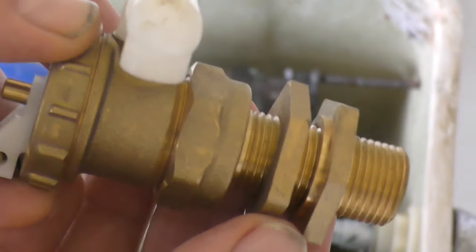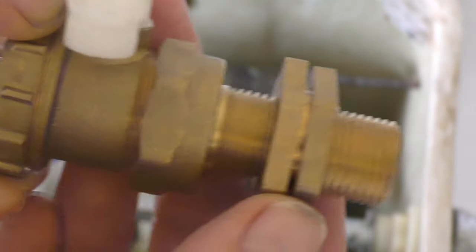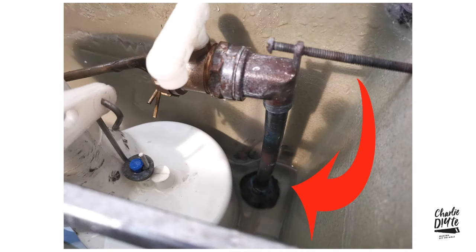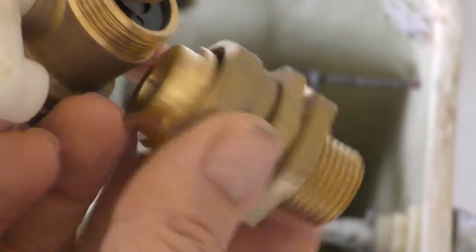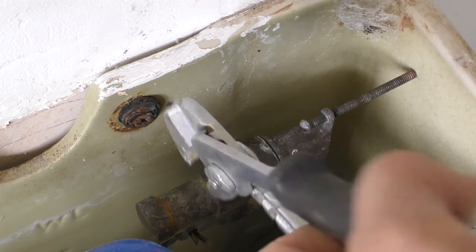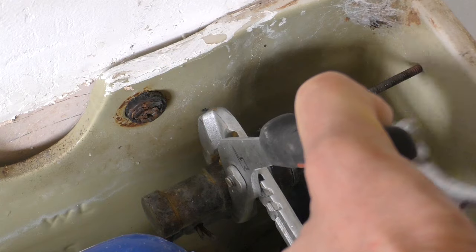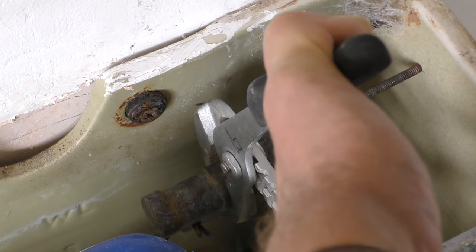We know the water's off, so it's on with the repair. This is a silently-operated float valve, with rather nice brass - most are plastic now - spigoted back nut and flange back nuts designed to be clamped against the side of your water tank or toilet cistern. My valve is a bottom entry float valve but it's sort of designed the same way as a side entry valve, so I'm hoping to dispense with the inlet shank entirely and simply screw the body of the new part two float valve onto the coupling nut of the existing shank.